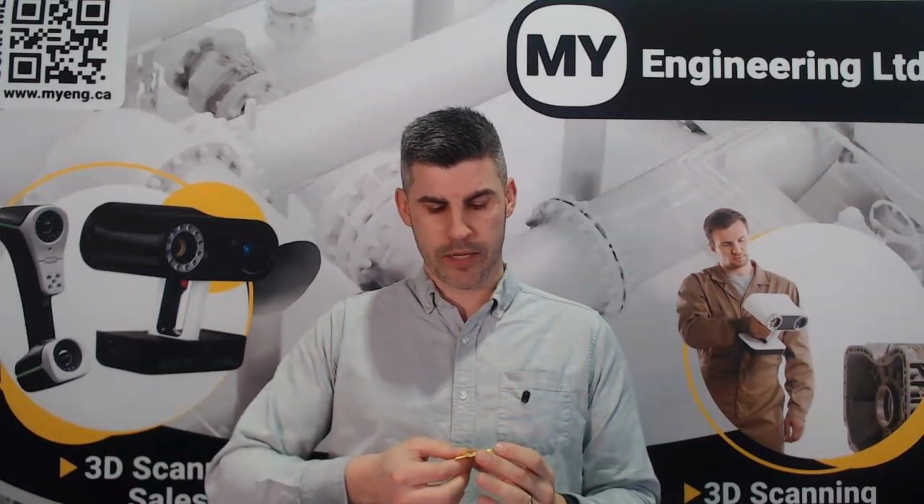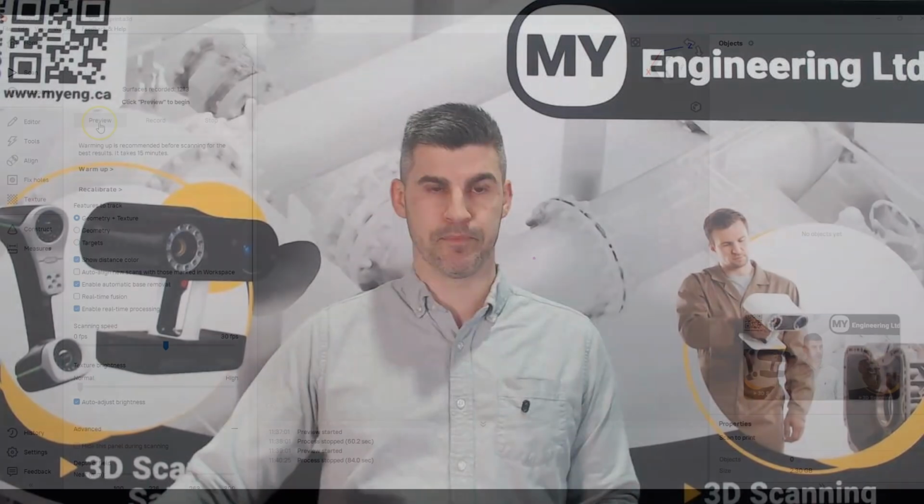The other thing is it's a relatively shiny object. So I'm going to use Artec sublimating scanning spray on this. I'm going to use our AB6, which is a 6-hour sublimating spray. We only need a light dusting, not a whole lot, but it'll give a lot better chance for a good return for the scanner. So again, we're going to have a nice, sharp, clean model.